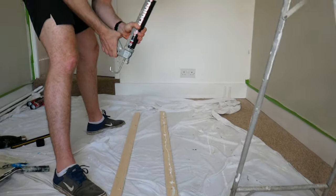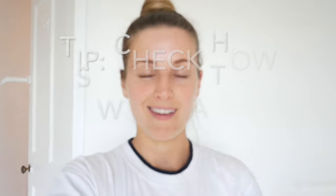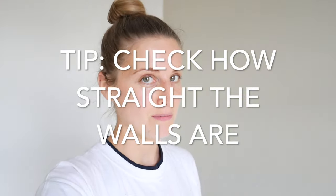This no-nails glue is so quick — we literally just hold it on there for about 30 seconds and it's fine. Okay, paneling fail number one: don't ever assume that your walls are completely even, because ours are completely warped and there's like a two-inch gap behind the panelling in the middle.